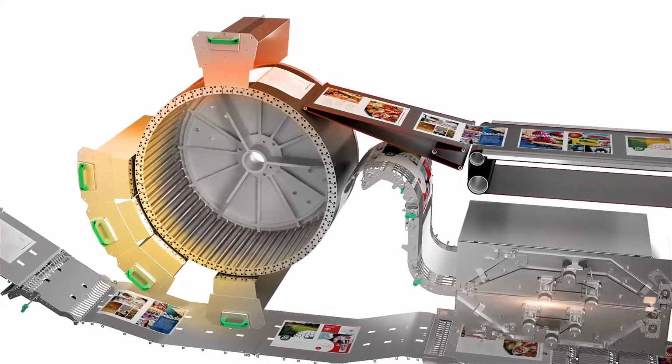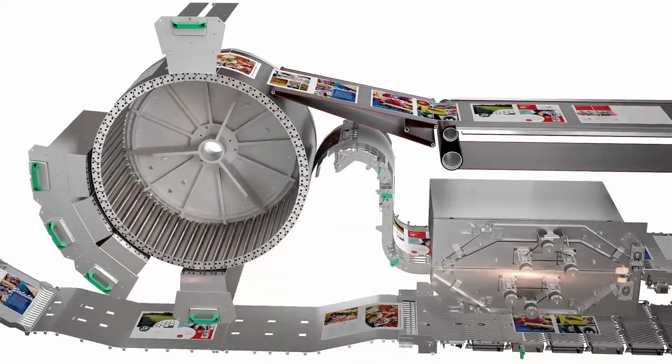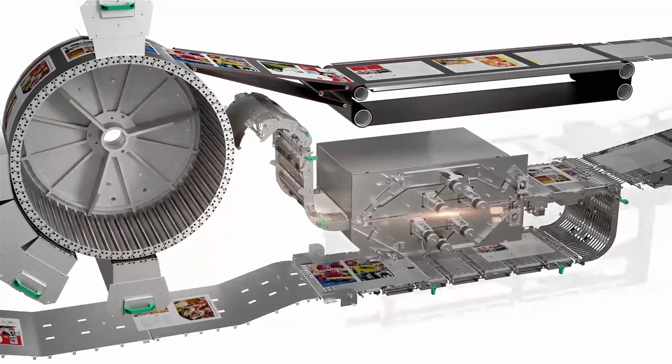Although the ink is dry after 1 step, not all sheets will have that robust layer of ink yet, especially heavyweight offset coated media. During step 2, the polymer particles in the ink are exposed to a high temperature to melt the particles into a firm layer protecting the printed image. This post-fixation step is unique to the industry, delivering an instant high humidity heat shot of up to about 290 degrees while avoiding over drying the paper. The result is a robust print on a flat sheet.